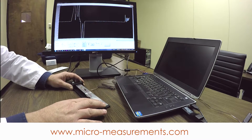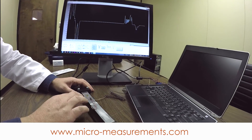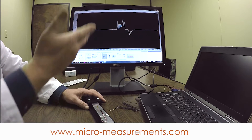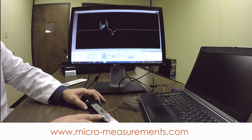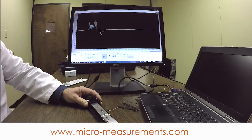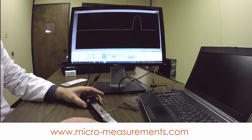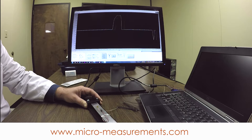Now we can get a little more resolution. A very common question is: once you've gone through the process to install a strain gauge on a test object, how do you know if it's working correctly? It's called zero return. This is 2024 T4 heat treat aluminum, so it's very spring-like material. If I apply a strain and then let go, it should snap back to zero microstrain very reliably. A strain gauge that's not installed correctly will not exhibit a good zero return. The fact that we're seeing a very good zero return here is our best indication that the gauge is functioning correctly and that our strain measurements will be accurate.